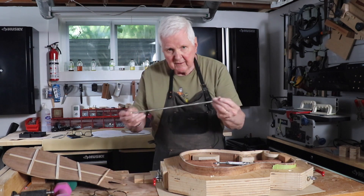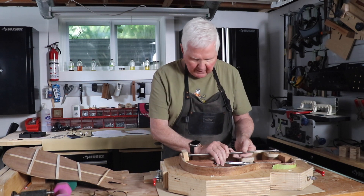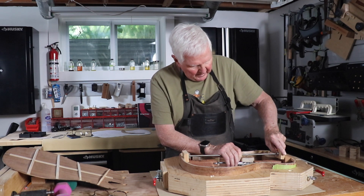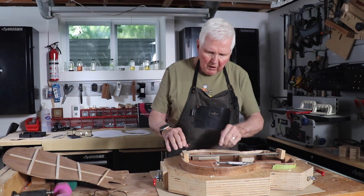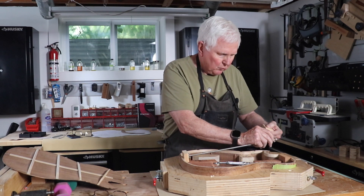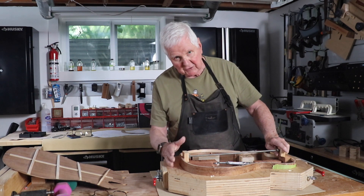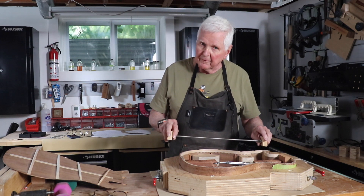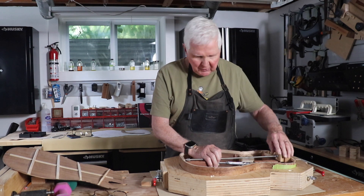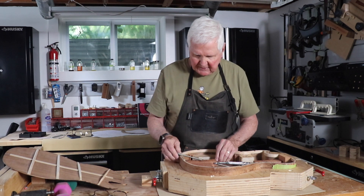This is the brace I used inside the guitar — on the top we put one piece of wood, I put the other piece of wood here, I've got a hole in here, and then that goes in like so. All you do to make it stronger is turn the wing nut on the threaded bolt and it pushes this out further, tightening it up and moving the guitar into shape against the edge of your form. That works great for either the back or the top, but not both — because once I put the back on, I can't get this out through the hole since there's not enough room.